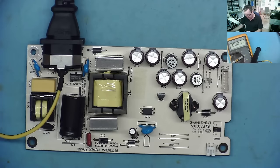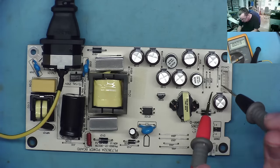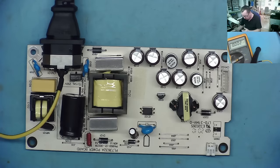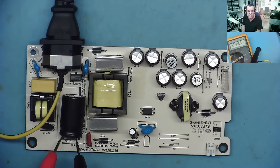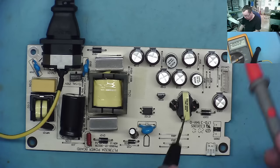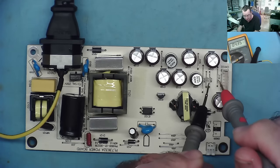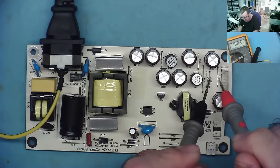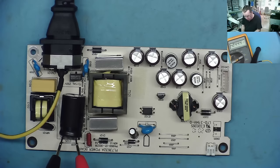There's about 4 volts, so it's charging — and this charging tells me the power supply actually does run. Is there any voltage on the output considering there's no load? Let's switch it back on again and let's see if the power supply is running — that's another possibility, that this power supply is running just fine and the problem is in the monitor. So we're on. We should have a high voltage here: 320 volts on the main cap. And five volts — it's a five volt supply. So it looks like the power supply actually has nothing wrong with it.